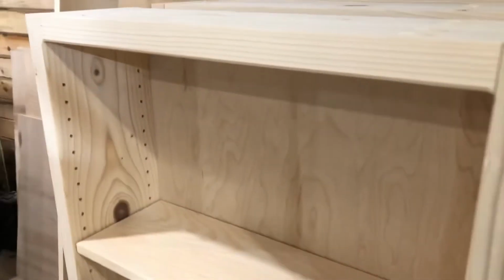Make sure your sheet's nice and square. And when you put it on here, it'll square up everything. Let's get after it. I like to usually start from the bottom. Get it all nice and true, straight across. And then go up the side and keep the plywood right on that side. I got these thick sides, remember, so I got plenty to nail to.